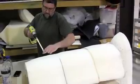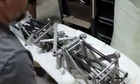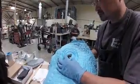We recreated the core of the neck sculpture in foam, cleaned out the center of it so that the mechanics could be within that. Then we covered that portion in spandex so that it would slide on the foam latex skin. With the head, as with all creatures we build, we try to get as close as we can within our limitations of how many servos and motors we can fit inside of it.